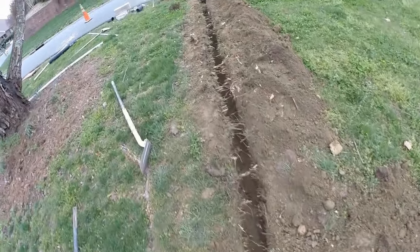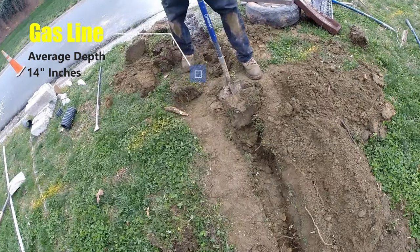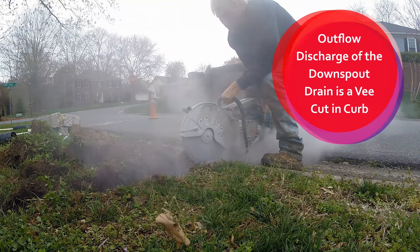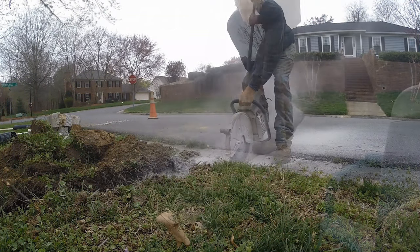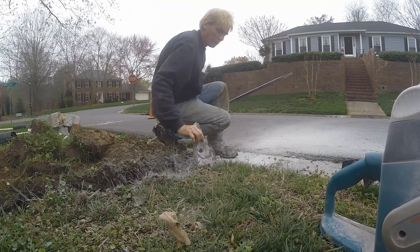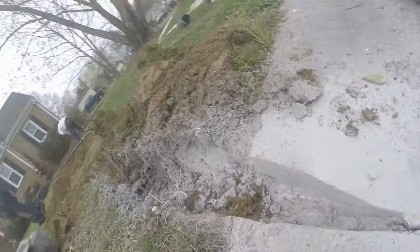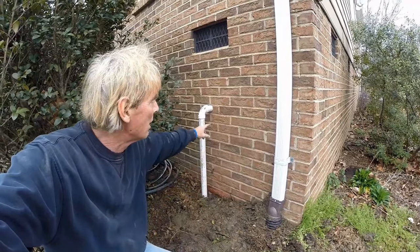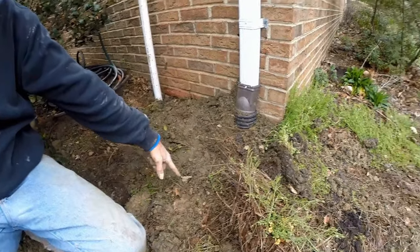Here's our trench completed. Gerald's got just a couple more shovels to go. One last thing for us to do is cut the curb. We could put a pop-up here, but we much prefer to bring the water out to the gutter system in the street — that's where it belongs. It will flow through the gutter system to the storm drain on the corner. That's by far the best way to discharge water. There's our little V-cut right down into the curb. The pipe ends right here. This is what it looks like after it's been plumbed — the pipe comes through the wall nice and clean, comes down into the ground, makes a 90, comes over and tees into the downspout drain right here.